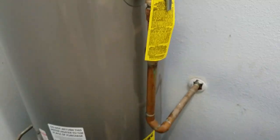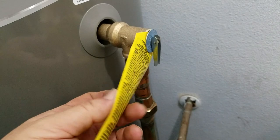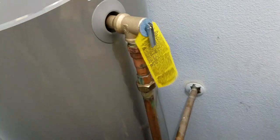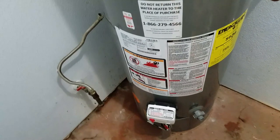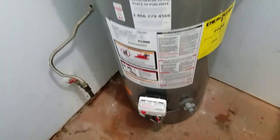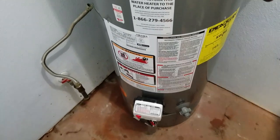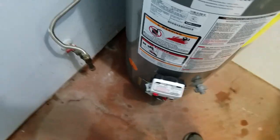The overflow line is hooked up and installed — and apparently do not tear this tag off because it's a federal offense, which just makes me want to do it, but I'm not going to. Next thing is to hook up the gas. The deal is I don't have any pipe dope for gas, so I've got to run over to the shop and grab a little can of that. I'm going to take the fitting off the old furnace, pull this little bung plug out, put that fitting in, hook this up, and then spray some Windex on there to check for bubbly bubbles.